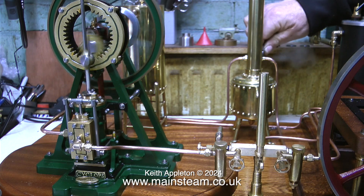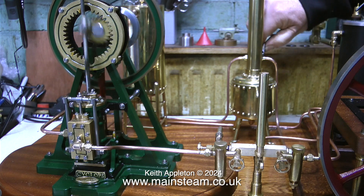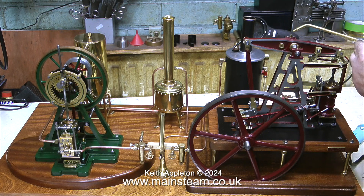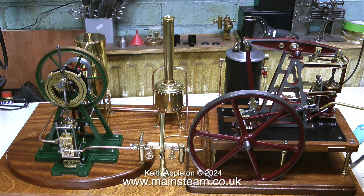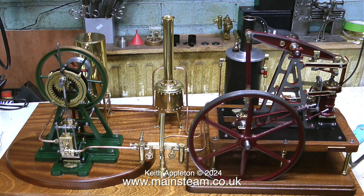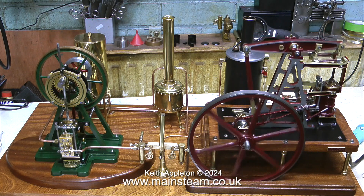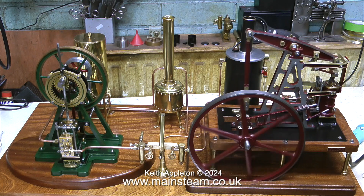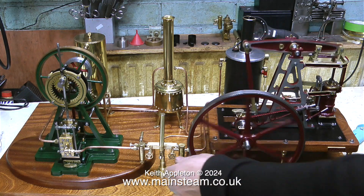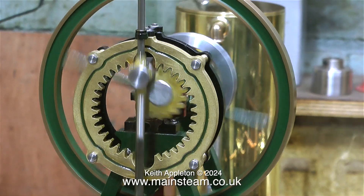I've taken the chuffing apparatus out of the chuff pot because it was far too loud — it's up to the owner of the steam plant as to whether he wants to put it back in. I also have a steam leak, and it's not the union — it's my bad silver soldering. I was trying to be economical with wire silver solder that I don't normally use, and I'm not going to use it again; I prefer the sticks. It's a very simple fix though: I just removed the pipe and re-silver soldered it. That's it for this episode of Top Tip Time — stay safe, stay healthy, thanks for watching, and I hope you found it useful.